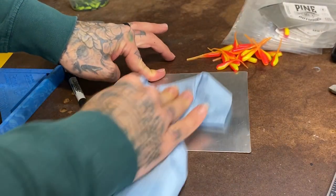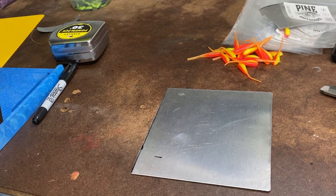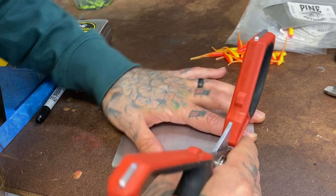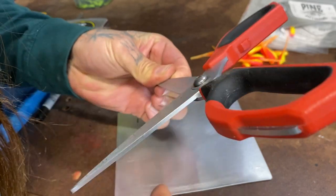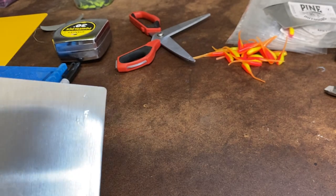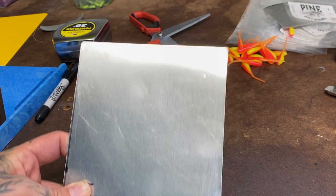I take a little bit of my worm oil — I buy it by the five gallon bucket — and polish it up and clean it a little bit. Over time this Sharpie mark is definitely going to come off, so a good tip is to take something you can imprint into the metal with and make a little scratch — maybe put your arrow here. That's what I'm doing here. It makes training easier too: you can just say 'hey, make sure you always have the plate in this orientation.' Having that marker up in the upper right-hand corner tells someone this goes up all the time. The reason that's important is you keep this side lubed, it keeps your fingers dry, and you don't get your packages all nasty.